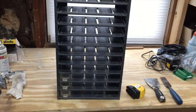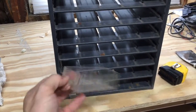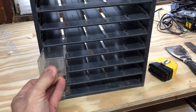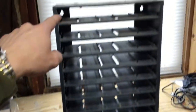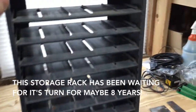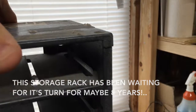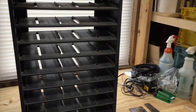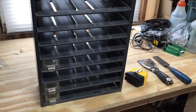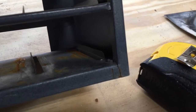Today I want to talk about how I repaired this storage rack — a small compartment storage rack. It consists of small little drawers, five in each row and 12 rows, so 60 total containers. It's thin gauge steel with some spot welds. The welded places separated, as well as cracks in the steel frame itself. Pretty much all four corners are damaged and it's all wobbly. Those are the cracks on the bottom part of it.